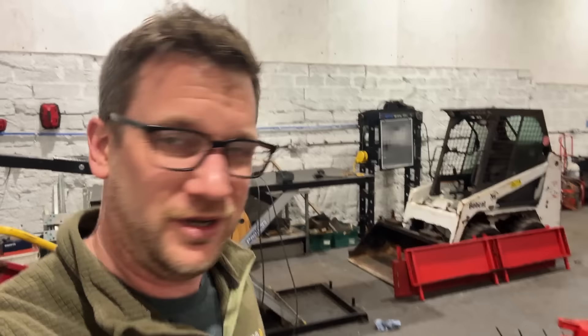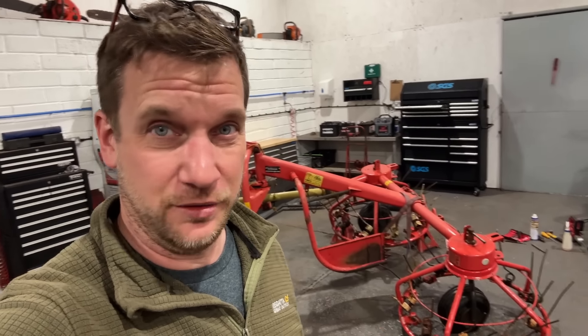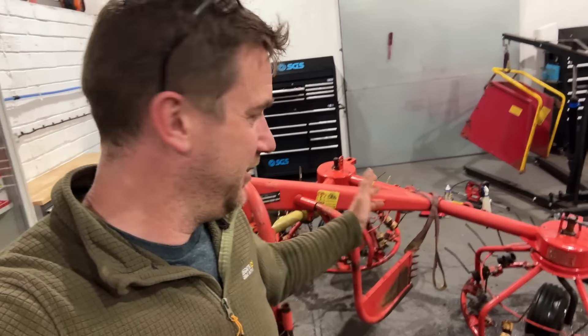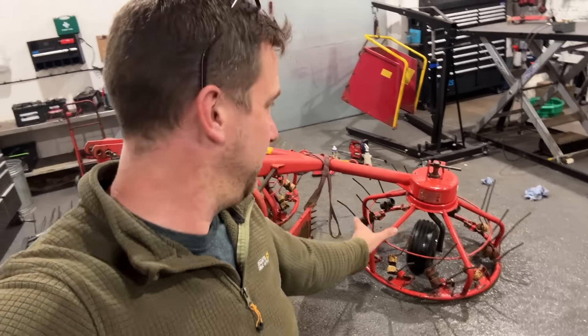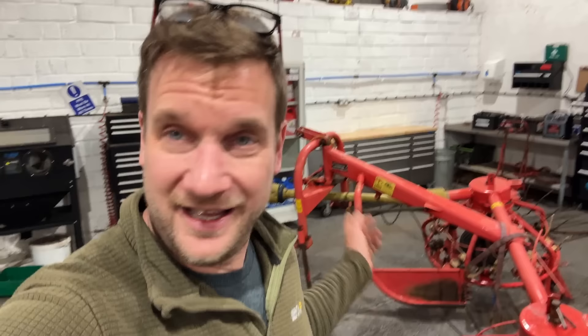We're doing a time lapse of this other bobbin rather than filming it individually. This is a 300 series Hay Bob, probably one of the most popular on the market. I used to have a 200 series - the original Hay Bob. The easiest way to tell the difference: the tyres on a 300 are about three inches wider than the 200's much narrower wheel. They also made a 360 and a 380 Hay Bob which were telescopic, so you could control the width of your row - these were generally used more for rowing up than tedding.